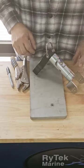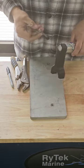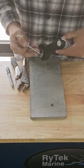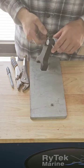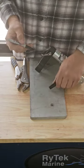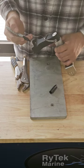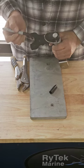Alright, so here we go. The pin is in there and you can see it's very loose. These pins are extruded and they're not round — if you take a caliper on it, the dimension changes when you turn it around. Just the nature of the beast, and since I don't make them I can't confirm their tolerances. So this is what we do — we're going to tweak that pin. Take a Sharpie marker, and with the clevis pin flat against the connecting rod, right at the top you're going to make a mark just like so.